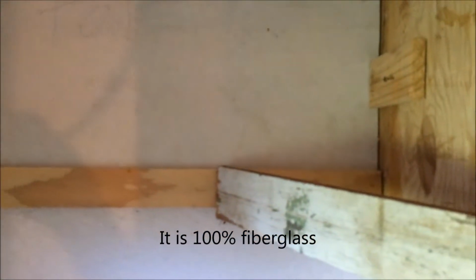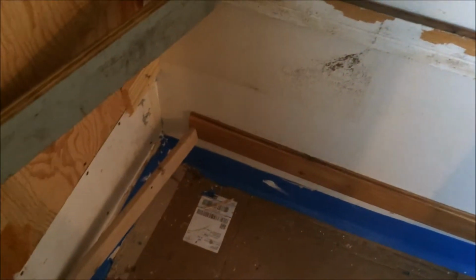And in the shower, the back wall of the shower, we've cut a piece of the old ceiling and caulked it, glued it to the wall. It's pretty challenging because it's a full-size sheet and it's taller than the doorway and it's wider than the shower itself, and you got some pipe sticking out. But anyway, we got it in here. It did not want to sit flat against the wall, so I put some screws up high where the trim will cover it, and then it hung, and then we just put some braces horizontally and kicked them to the corner. And I'm going to leave them overnight, and hopefully the caulk will hold it forever and ever.